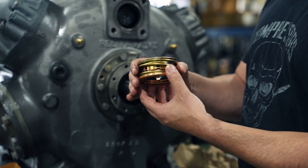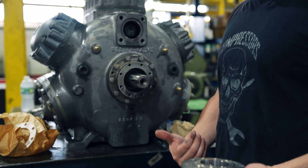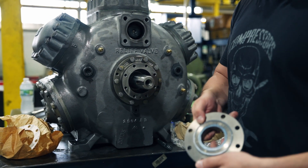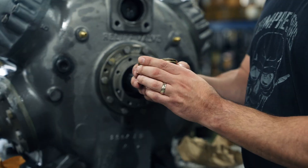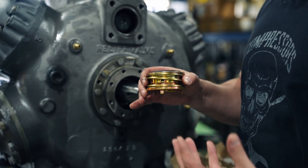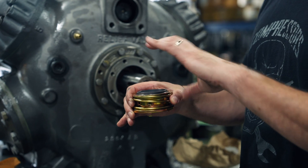On the dome style you're going to have an insert that you'll need to pull out of the dome and put in. This one does not have an insert. You're going to have the rotary cartridge seal, whereas on the older styles it's going to be more of a loose-style spring, so it's going to look significantly larger.